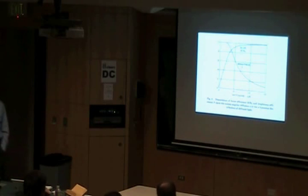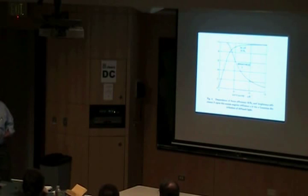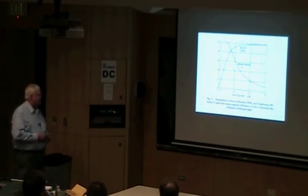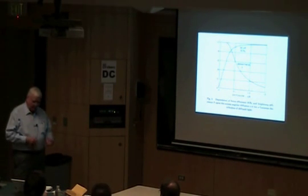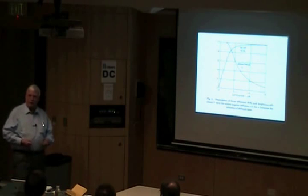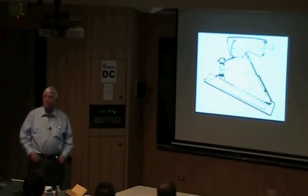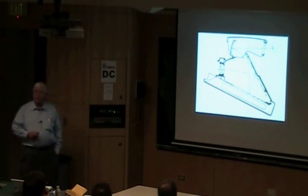See? Now, I have to admit that the analysis was all done after we'd finally made some good focus screens. You do this so you can publish it, right? But empirically, what I did was I was looking at a bare light bulb over my head while I was doing this and trying to guess how big a spread I wanted. After I had it, I did the math. But it worked very well. So that is in this position. It takes the light from here that hits all corners of it, brings it all back together through there, and it comes out.